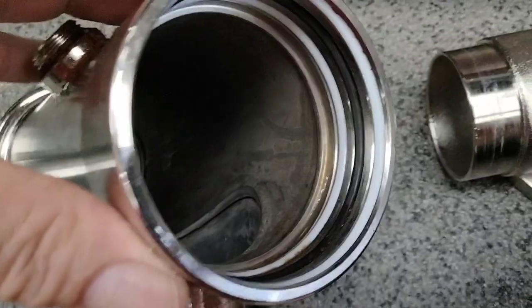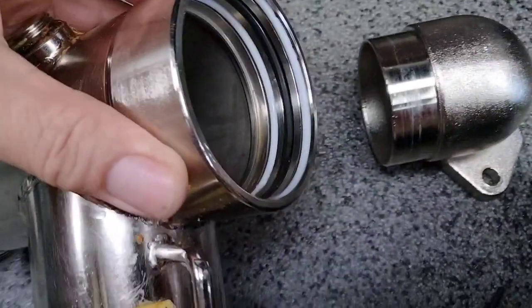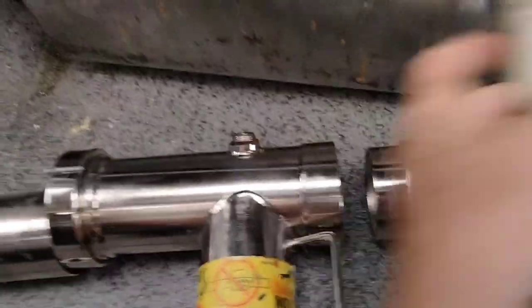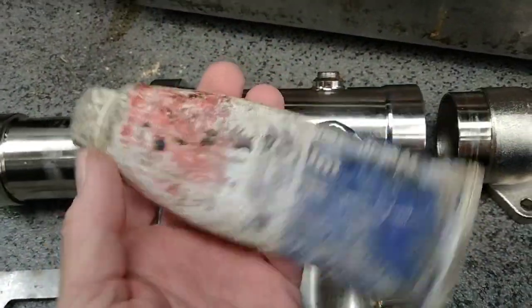Another thing — they don't put any lubricant in here. If you're unfamiliar with it, there is a Teflon-to-Teflon seal and a Viton O-ring. You can get these for like two bucks from McMaster-Carr — don't ever pay Pitco prices for these things. I'll reassemble it with some food-grade Lubra-Film. I've had this tube forever, and that way they can just slide in and out really nicely.